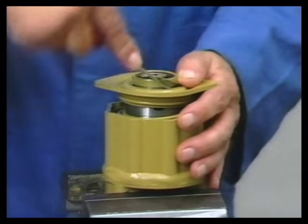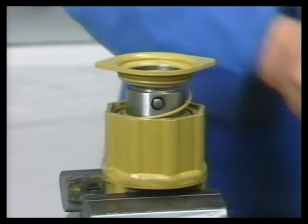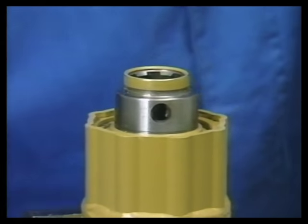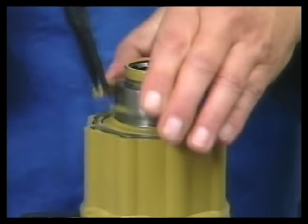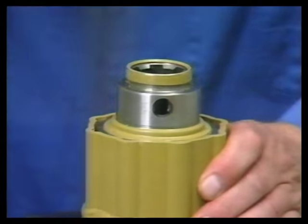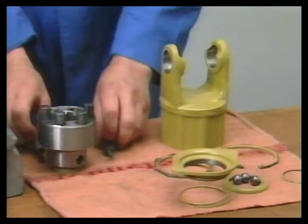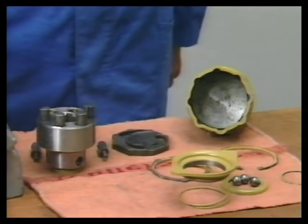First, remove the pull lock. Remove retaining ring. Lift off spacer ring and locking sleeve and remove securing balls. Now release circlip and remove support ring. Untension pin freewheeling unit and pull hub horizontally out of the housing. By hitting the housing against the work table, the driving plate falls out. Dismantling process is completed.